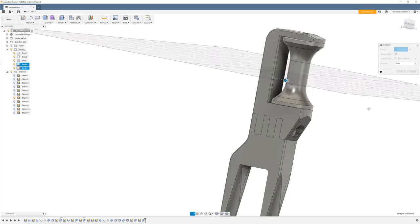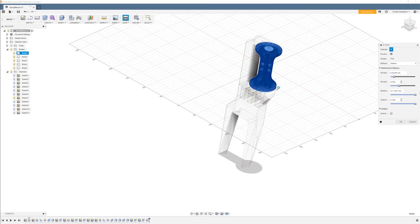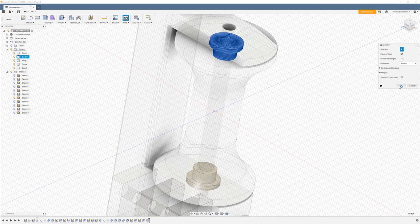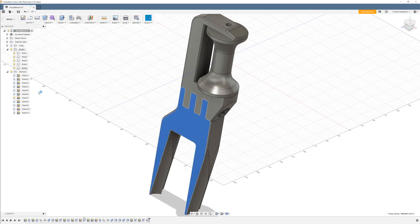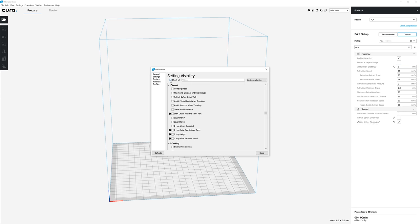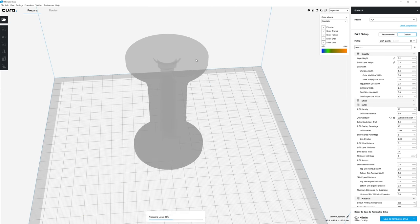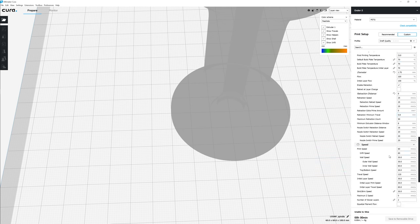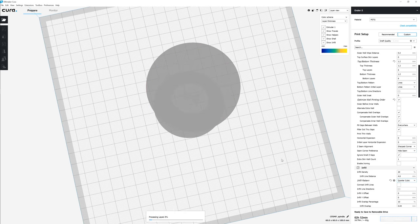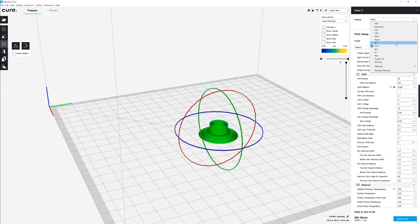Next up, saving every individual part into an STL. Fusion 360 has a really nice 3D print feature where you get a pretty accurate representation of how detailed your STL is going to be. To print these parts I took them into Cura 3, created a quick profile for the Ender 3, added brim, and turned on automatic variable layer height where the layer height adjusts based on the slope angle in your part. I think that works out really well — it saves time and makes overhangs print really nicely. With appropriate shell thickness and infill, we are off to the races.